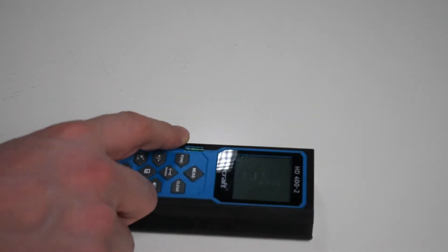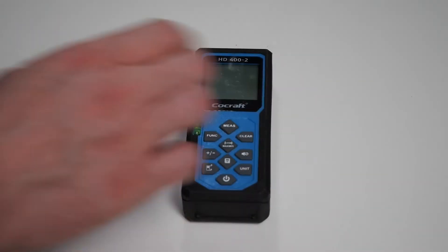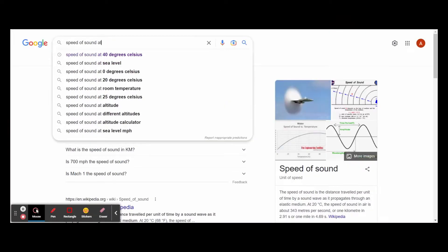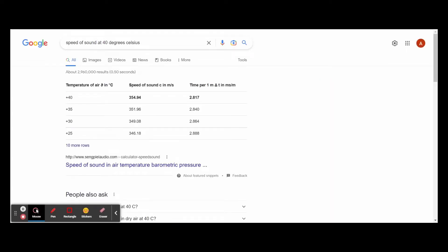Let's talk about calculating this delay. In this video, we're going to look at a rough-and-ready way of calculating and roughing in a delay speaker, and that is using a laser distance measure. It is possible to use a two-channel measurement system like Smaart to perfectly align the speakers using the phase chart, but I'm not going to get into that now because you don't want to drop a thousand dollars on Smaart just to solve your first delay speaker problems. Leave a comment down below if that's something you'd like to see. I mentioned the speed of sound earlier, but that is the speed of sound at sea level and at 20 degrees Celsius. The likelihood of it being exactly at sea level and exactly at 20 degrees Celsius is pretty low, and there's actually quite a lot of variance in the speed of sound affected by just temperature.